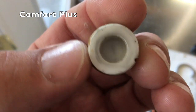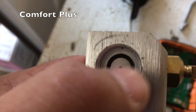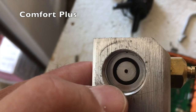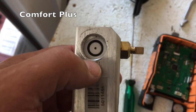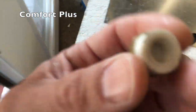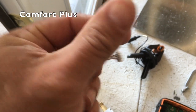Here's what the transducer looks like — you can see where the O-ring makes contact there around the perimeter. The O-ring looked bad; I took it out with a pick and it actually had some flat edges on it, had kind of gotten a little hard. So I put a little Nylog on it and screwed the transducer back in, and it would hold pressure. But the transducer itself doesn't work — I don't know if I did something to it taking it apart, or if all that liquid pouring across the wires did something to it, but it will not register any longer.